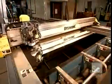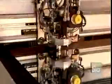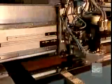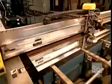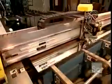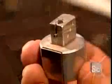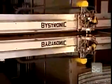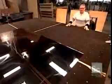The factory now cuts these large panels into whatever size and shape the customer has ordered, using a special mirror cutting machine that's precision guided by computer software. It scores the mirror using a carbide wheel. Carbide is a strong metal. To make round mirrors, the machine first scores the panel into squares. Then in each square, it scores a circle. Using special tools, workers separate the squares, then the circles.